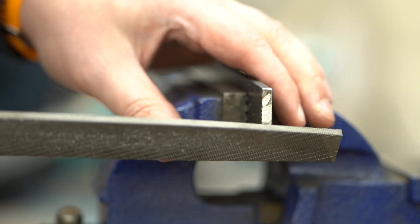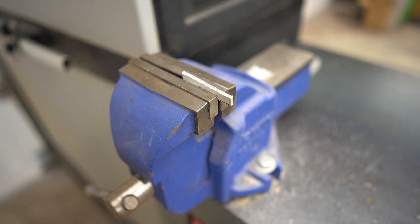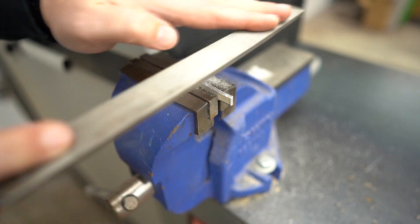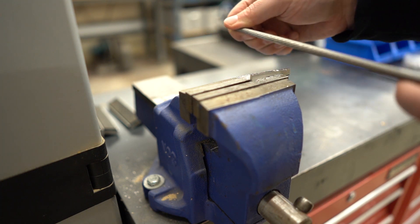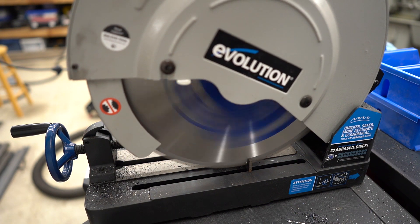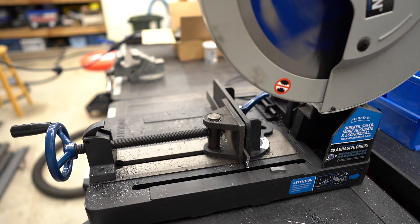Besides the obvious safety advantages, when we're fitting a couple of pieces together, burrs don't get in our way and cause issues with our fit-up. Don't underestimate the mighty file — I've machined parts with just a file. It's a lot slower than a milling machine, but you can do many of the same operations. I've made knives from scratch just using a file and a file guide. Files come in all shapes and sizes: triangular, square, flat, half-moon, round. For the next level of metal shaping and cutting, you get into power tools — milling machines, lathes, sanders, belt grinders, saws. These all work on the same principles as files and hacksaws, and you'll be better at using them once you know how to file correctly, because all the same principles apply — things just happen way faster.